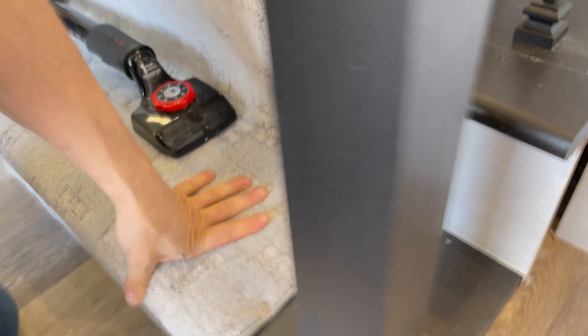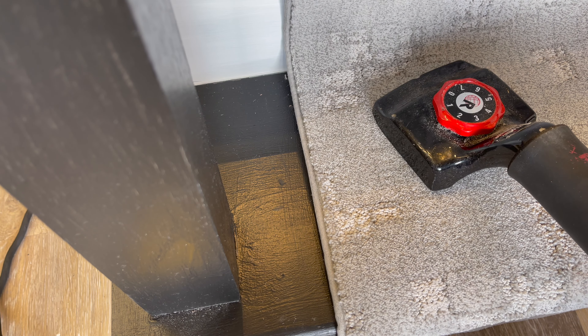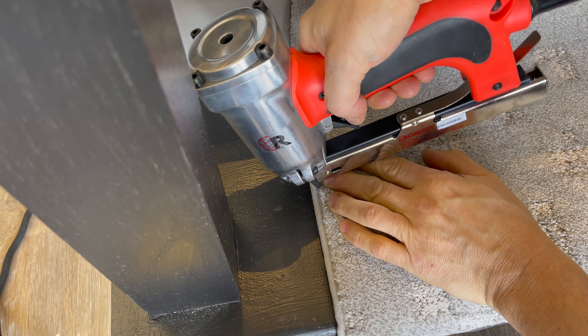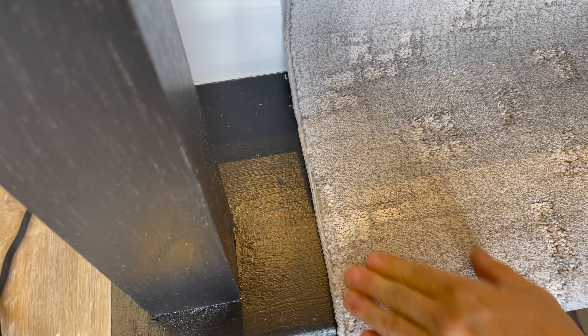You split the pile and put the staple in there, and then the pile actually covers that up and you don't see them. We're just going to put tension on the knee or thigh and push that in. Angle it a little bit — you can see the tension, see the thing move. Lots of tension. Split the pile right there and put it right in and hold it into place. Split the pile here with our finger, put that down, then rub those marks out. Looks pretty good, looks pretty tight.